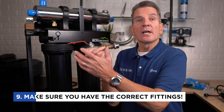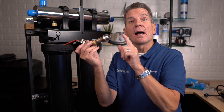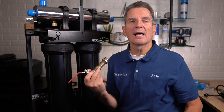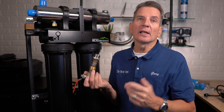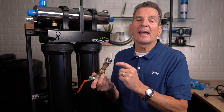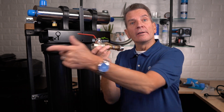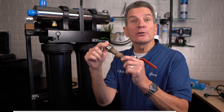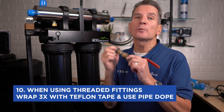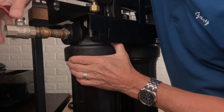Once you've decided what kind of materials you're going to use, make sure you get the correct fittings. This is a one-inch female connection, so since I'm using three-quarter inch here, I need a bushing to take it from one inch down to three-quarter inch. You can get these bushings in plastic, but I prefer the stainless steel ones from a plumbing supply place — the plastic ones can crack. You're also going to want to put a shutoff valve on the water coming in for future service. Wherever you use threaded fittings, wrap it three times with Teflon tape and use pipe dope to make a nice watertight seal.